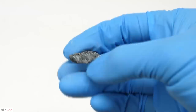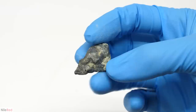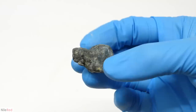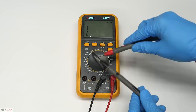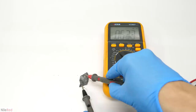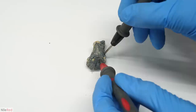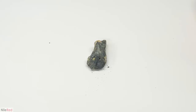The granule run was a lot less interesting, though it did kind of retain its shininess, which honestly surprised me. I checked back on it a few weeks later and it was definitely dulled out, but still kind of shiny. The last thing I wanted to test was their conductivity. Because they're all made of lead and zinc metal, they should all be conductive. Using a meter that beeps every time an electrical connection is made — the first one I tested was the compressed stuff, which immediately gave a beep. The piece from the granule run also conducted. The uncompressed powder ones were much harder to get a signal from because the surface was covered, so I had to dig the probes in a little. So basically, in conclusion, they're all conductive.